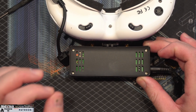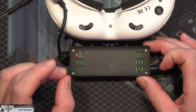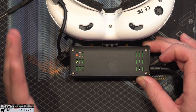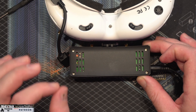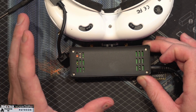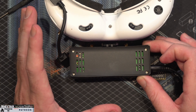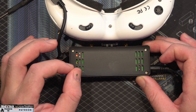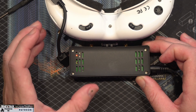If you find that LED doesn't go off after 20 minutes, the chances are something hasn't gone correctly. Turn them off and start the process again. The most important thing to check at that point is whether the device has deleted the files from the SD card, because that will be a hint to tell you if the update has completed. It is possible the format of your SD card isn't what the goggles likes, in which case go away, reformat it, and start again.